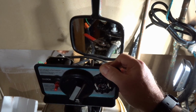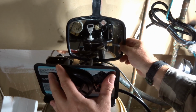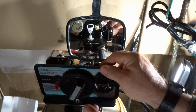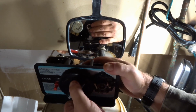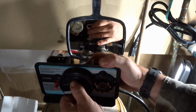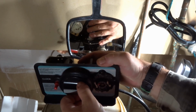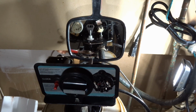And one thing you can do at this point, if I can get this mirror adjusted. Now, hopefully, yes, you can see it. So you have to get the piston lined up again on this main gear, and you can do that just by turning it. And it will find a spot, and then it snaps in. So at this point, you can leave it loose. And let's get that screw in the back there.